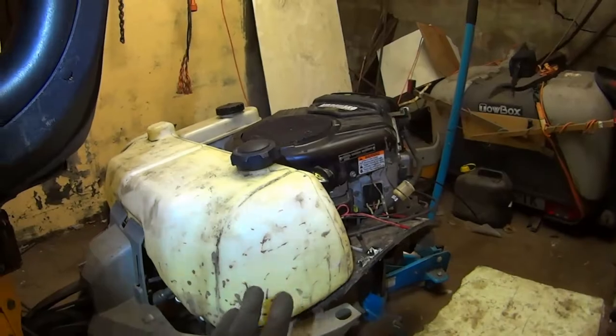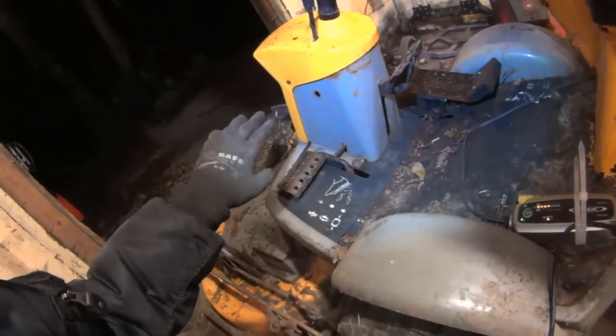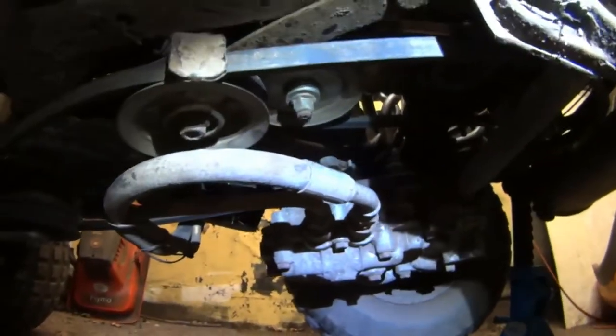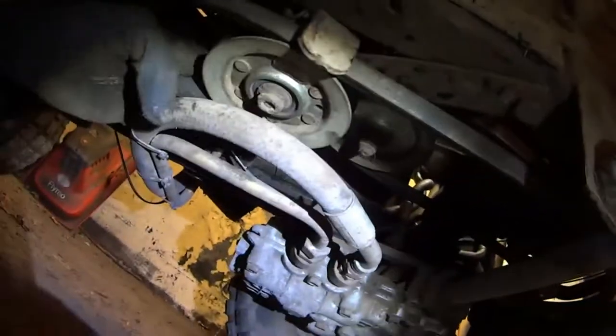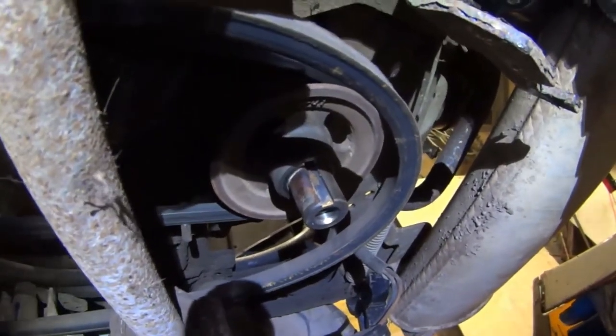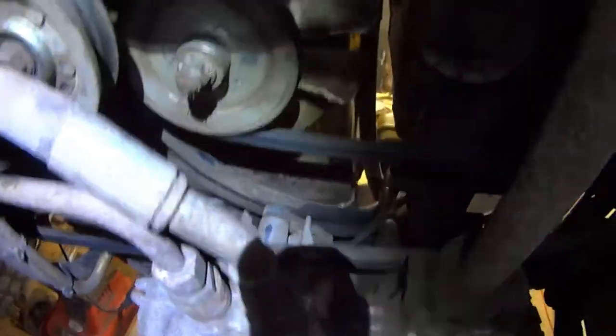When you turn the engine and you don't hear anything, but when you start to drive you hear noises — or when you engage the clutch — one drive belt is constantly feeding the hydraulic pressure pump. If that's making noises, this pulley here could be the cause. The engine bearing is in there too — if that one is making terrible noises, you're going to have a bad day. There's also a small black tension pulley that could make noises.